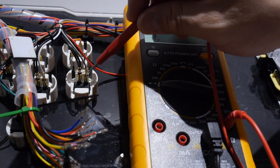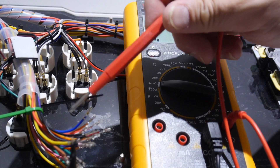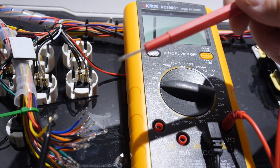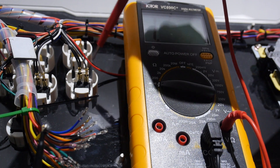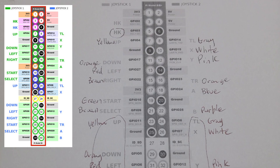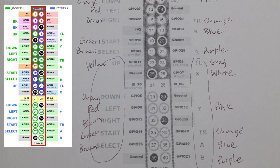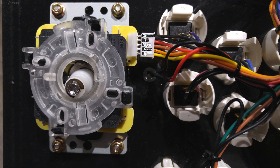To figure out what each wire does, either trace the wire through the harness to find out which button it goes to. There are a lot of wires that use the same colors, so it's easiest to use a continuity tester to help you figure it out — most multimeters will have it built in. Basically, you touch one end of the wire and touch a contact on one of the controls; if there's a connection, it'll beep. I printed out the GPIO diagram and noted what color goes where. If you have a different Pandora's box, the wiring won't be the same as mine, but this will give you an idea of how to figure it out. Since most joysticks used in Pandora's boxes are Sanwa, the pinout of the 5-pin connector should be the same, though the colors might be different. Make sure you use a continuity tester to trace it out.